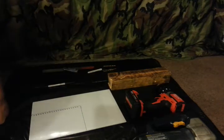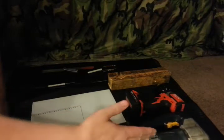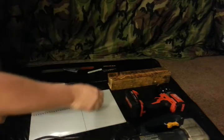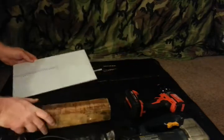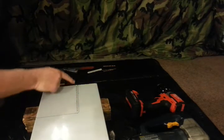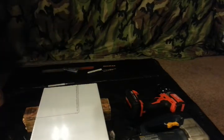Now, you can take your jigsaw, scribe it. Just keep scribing until it snaps off both sides. I'm going to actually use my jig and I'll cut this out. Then pre-drill all the holes and then drill the holes. And why pre-drill is when you use any kind of plastic, you can chip it if you try to go fast. Everybody knows that part of it. And for me, it makes it to where if you make a mistake, you can always even it back up.